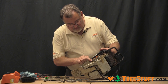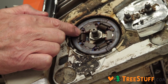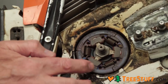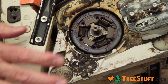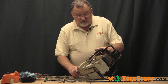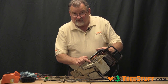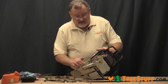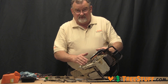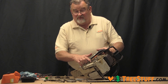This gives you a chance to inspect the springs and look for any wear on the end of the spring or on the shoe. You can see this shoe has been overheated a little bit, which is not uncommon when a chain brake is left on too long — that will cause the springs to lose their tension. If you have a chain that won't stop turning when it's supposed to be still, investigate the springs to see if they're broken or worn.